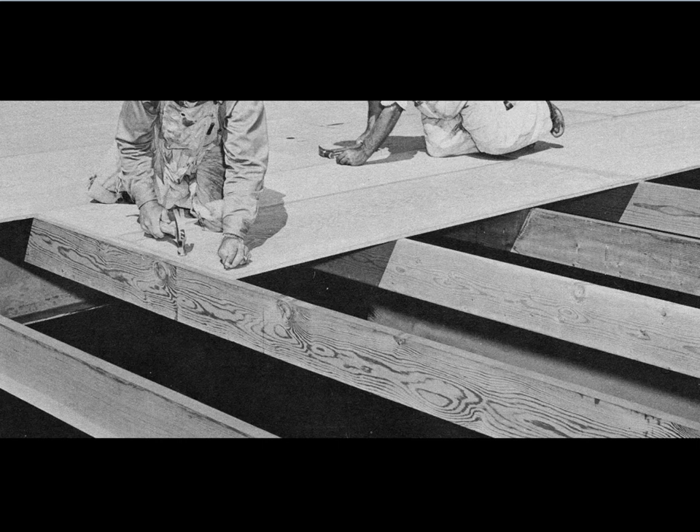This image shows plywood decking, three-quarter inch in thickness, being nailed down to solid sawn wood beams. Three-quarter inch plywood or oriented strand board can span up to about 24 inches between supports. It inherently is wide and fairly shallow, and its depth is determined for purposes of strength in terms of shear, moment stress, and deflection.